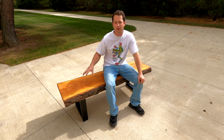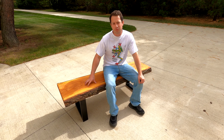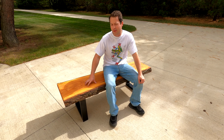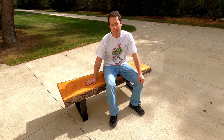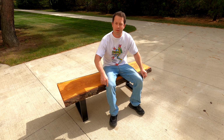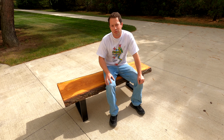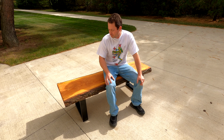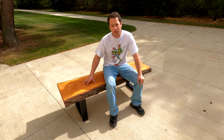Today's video I'm going to cover how I made this live edge bench. I had this piece of wood actually made from a guy that was buying some lumber from me. He has a sawmill, so he cut it for me for free. It's about 2 inches thick. And then I made the metal legs. They're made out of 3-inch by 1.5 inch rectangular tube. So I cut those. I'll go through how I did that. And then I just did a polyurethane finish on the top of it.